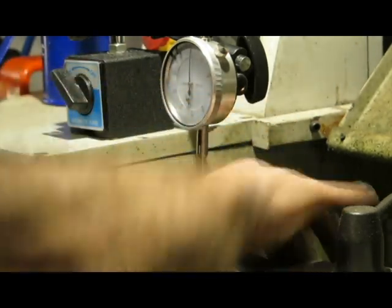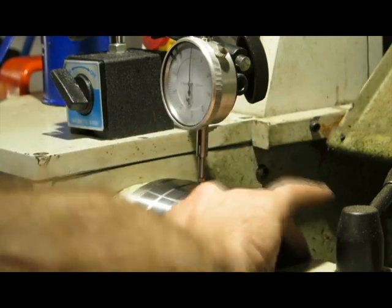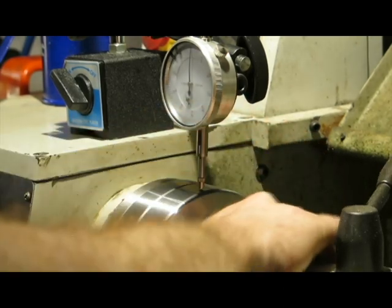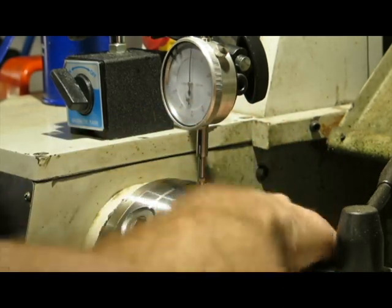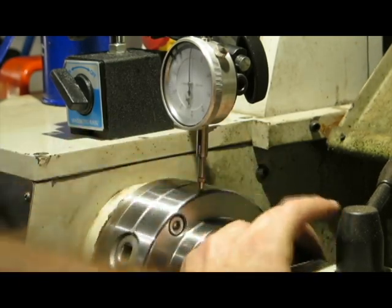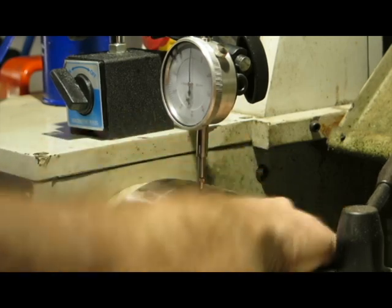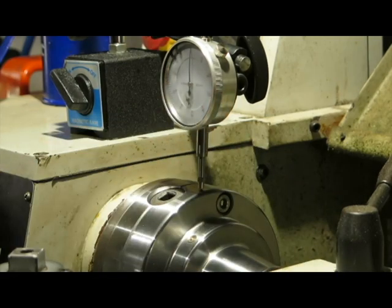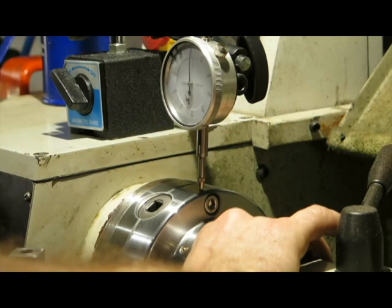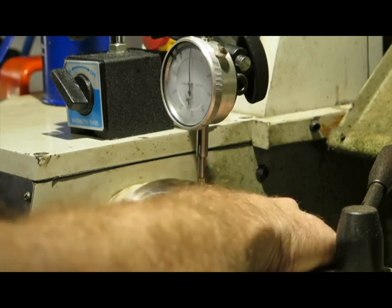Okay, so I'm just turning that now, and bizarrely, I've probably got maybe 1/100th of a millimeter of run out in that already. Not even. I'd say it's probably 1/100th, 1/200th, so that's the high point there,